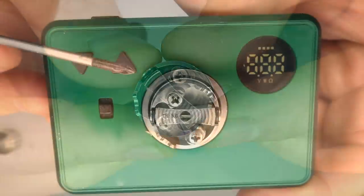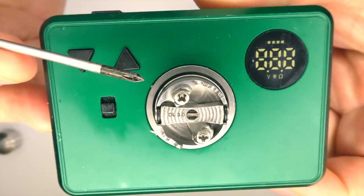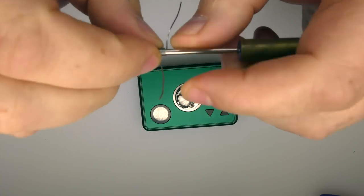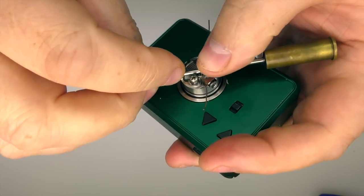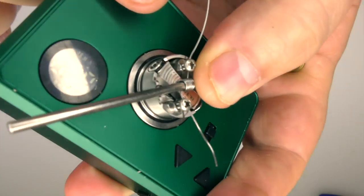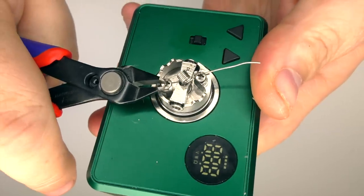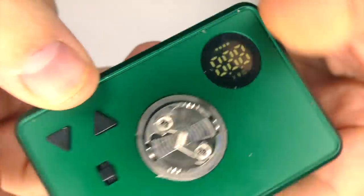Let's get a coil in here. The screws come out far enough to get your wires in, and there are walls on either side to stop the wire getting spat out. For this one I've grabbed some 24 gauge out of my drawer, thrown a few wraps on. I've wrapped it counterclockwise with leads at the bottom — it literally just drops in. It does have coiling guides there for a coiling rod, but when you use them you're resting right down on top of the bar, so you're going to have to lift your coil up. Don't forget to lift your coil up. Pulse the coil and give it a little quench.